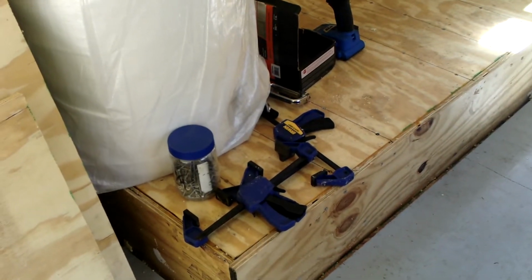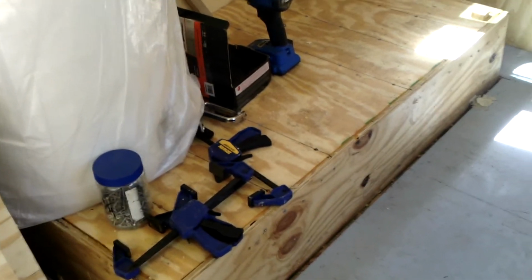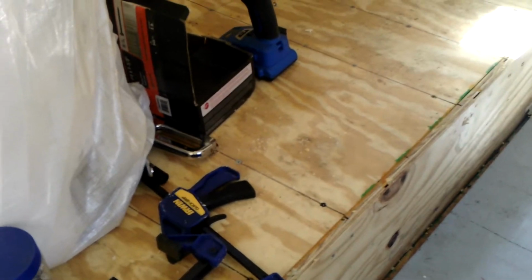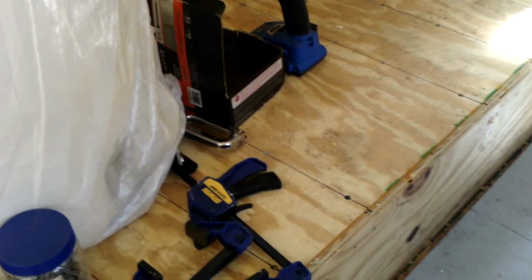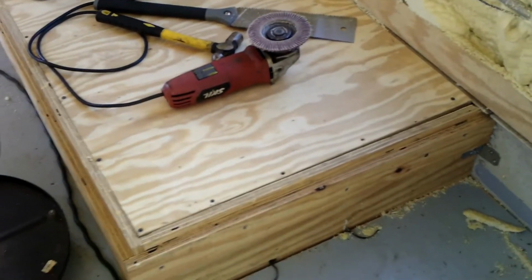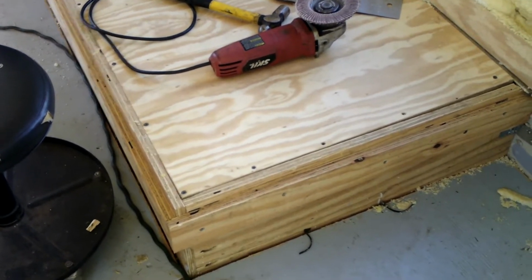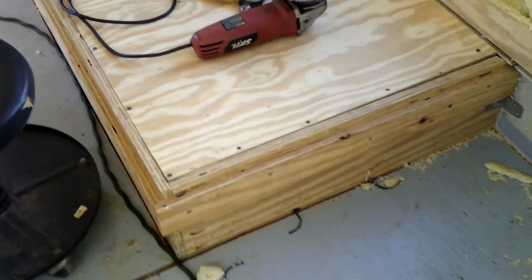Here we built basically rafters of sorts, for the addition. You can see the lines going straight across. That's because there's actually a rafter, kind of a 2x3 going across on the inside. And it's mounted to that sidewall. Whereas the strips of the 3/4 inch plywood on this one, they're glued and screwed. The reason is this one's not going to hold nearly the amount of weight.